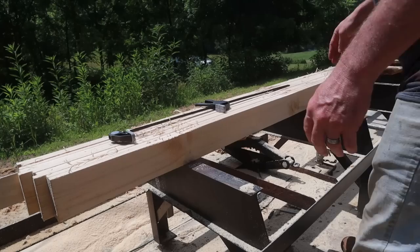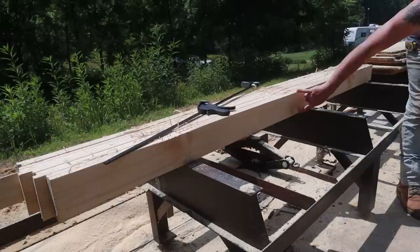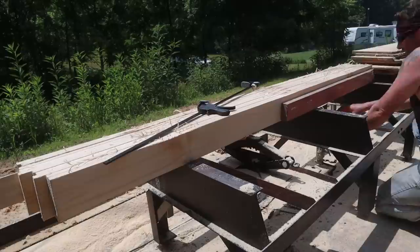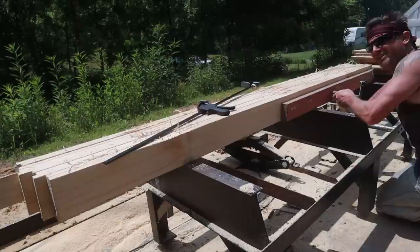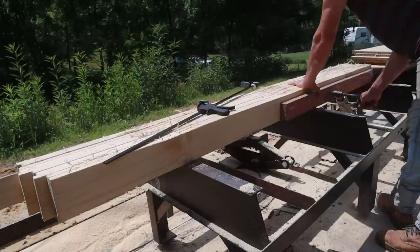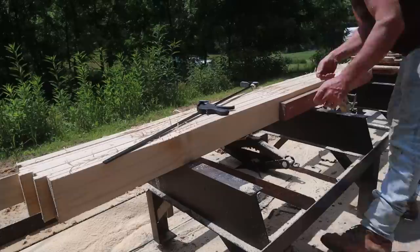I bought one of these, they're way too long, but just one of these clamps. So normally, when you have a bunch of wood side by side like this and you're cutting the width of it, I usually grab a board, like this scrap piece of cedar here, and then I'll clamp everything down, so it's out of the way of the blade. And all this does is it pushes everything up against the backstops, right? The problem with that is that sometimes the pressure is only in one spot. And you go tighter and tighter, and as you're doing that, these down here are kind of loose and they're free to wiggle around.